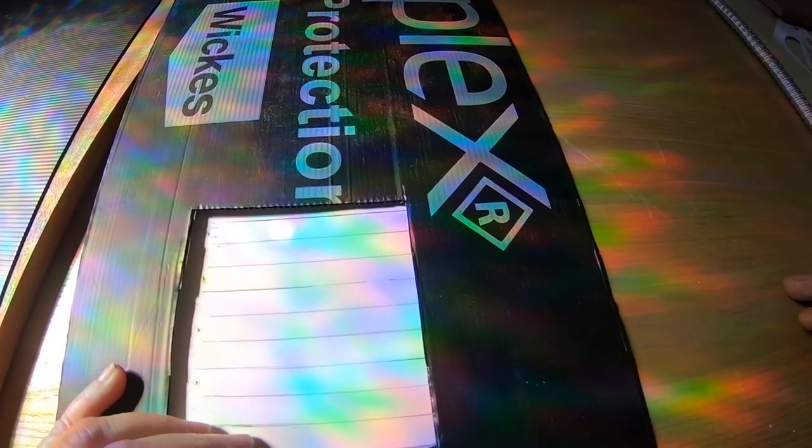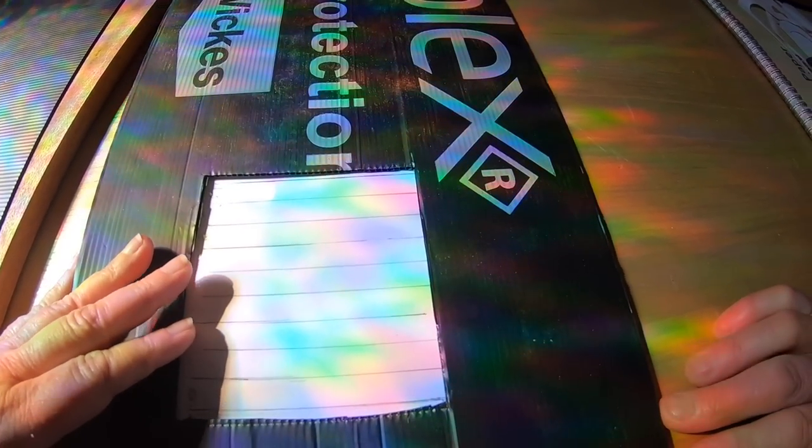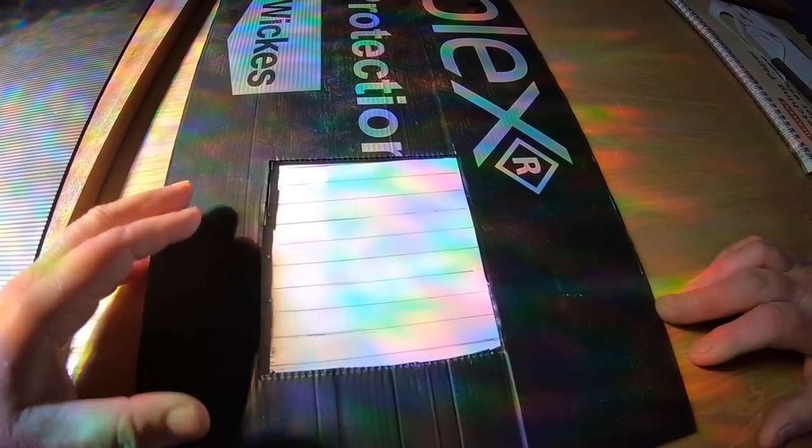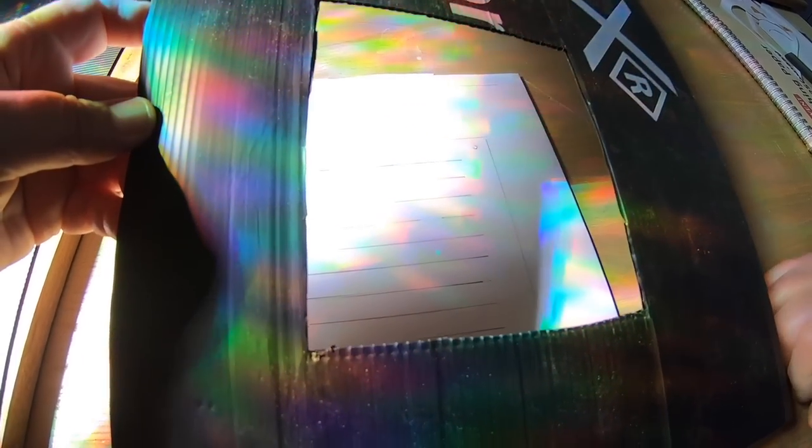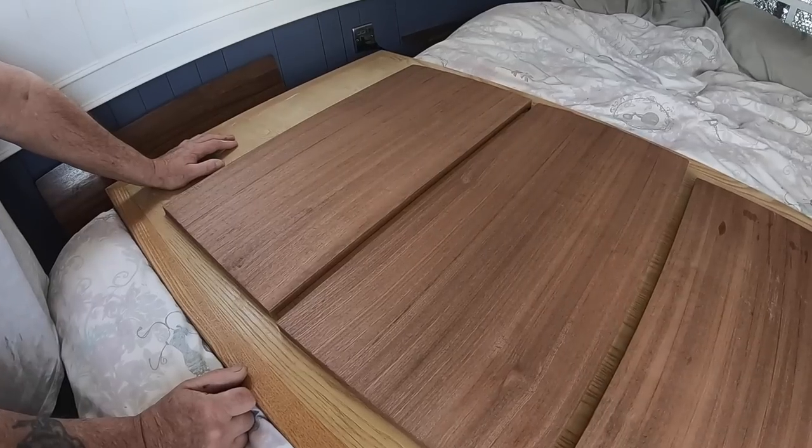This is the drawing of the air vent outside and the spacing of each of the gaps. But that would be too many if we are cutting this out of wood, so we're going to miss a gap, have a gap, miss a gap, have a gap. We've offset them so they don't correspond with the grill on the outside, so that if anybody lays on the towpath and looks through the grill, they can't see in with no clothes on.